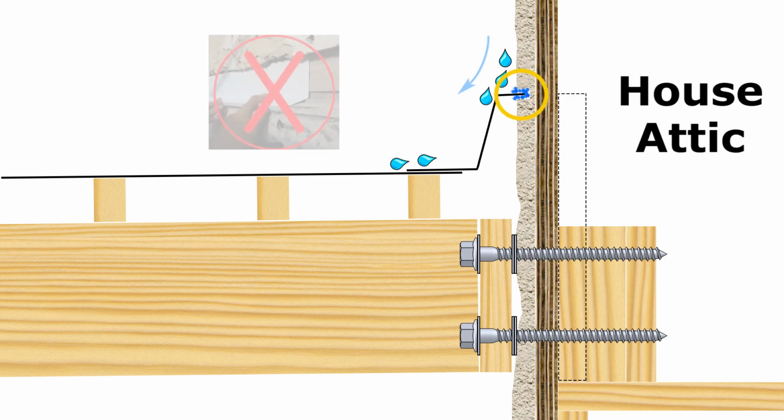So instead of opening the stucco wall and installing flashing, I decided to cut a horizontal groove on the stucco wall and insert flashing into it. Then seal up the groove with silicone caulk. Fortunately, it turned out to be a simple and efficient method, and here are some photos of the finished flashing